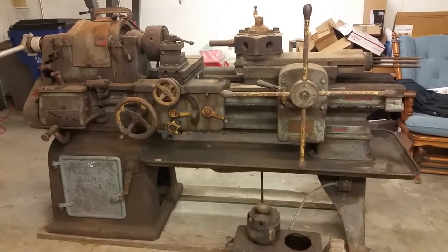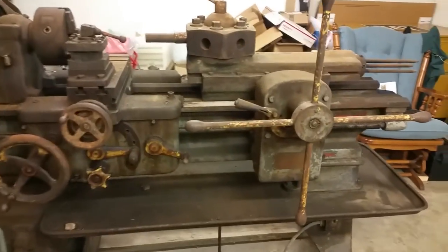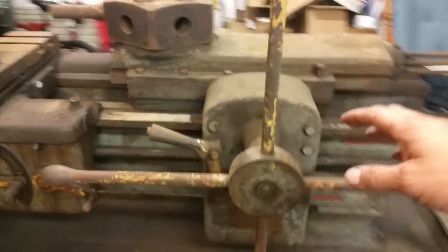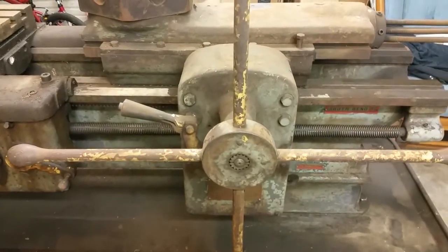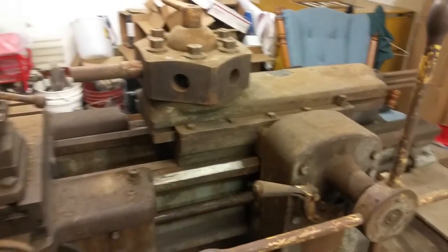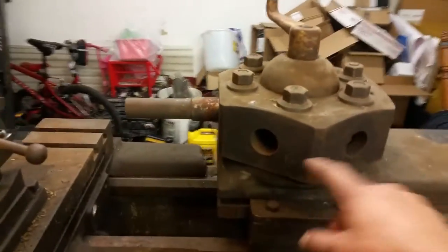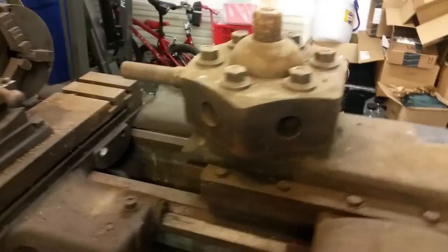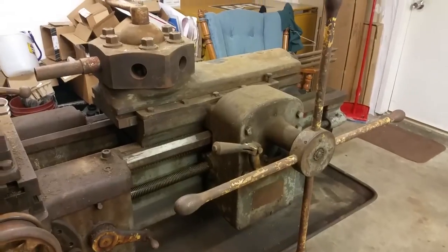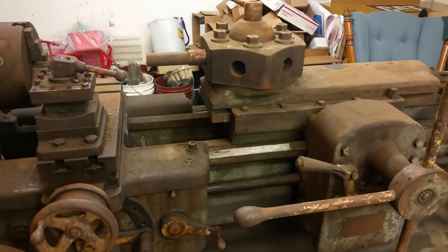Before we begin, a little bit about it: the number 2H is our turret lathe, which has to do with the tail stock end. You can see we have this extra apron on the tail stock, and the tail stock is somewhat different. The turret lathes were more designed for high production — you could put different attachments in each of the six holes, and as you work this mechanism on the apron you can rotate the different attachments to go at a reasonably fast pace.